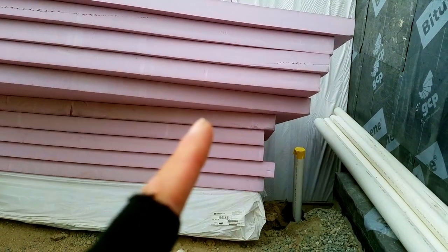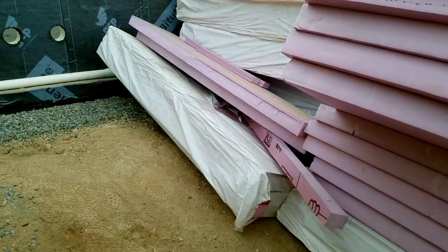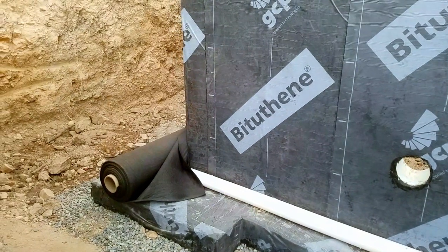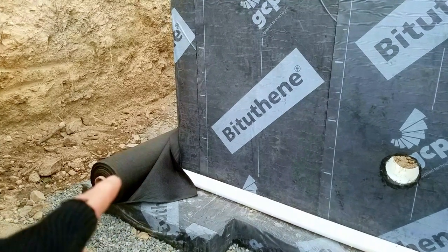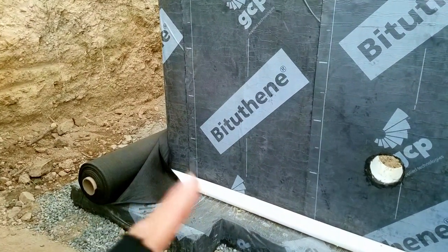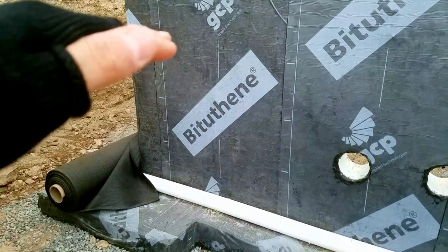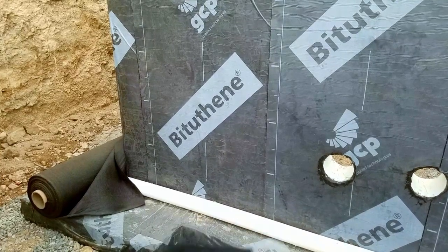This is actually for the next episode, so stay tuned. Can you believe we're actually in December? We're in zone 7 and it's actually in the 40s and 50s — pretty warm given the circumstances. Here's the geotextile fabric. My plan for tomorrow is to cut it and make sure I have enough for the entire back perimeter of the house. After that, I'll be placing the pipes, making sure their slope is diverting water from the high ground at the back of the house to the front where the exits to daylight are.